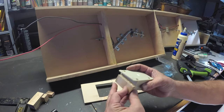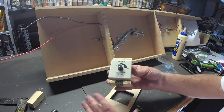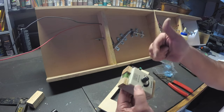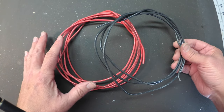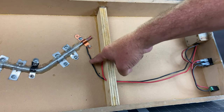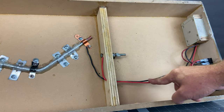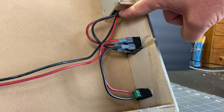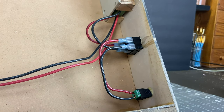I'm using a hot glue gun to secure the dimmer switch to the back side of the face plate. Before I mount it — and before I make another mistake — I'm going to wire this up first so I have enough room to get in and out before I put it on the plate. I've got some heavy duty 10-gauge wire left over, but you don't need to use this — you can use any size wire you want. The wiring is actually quite simple: the black or negative wire attached to the zinc bar goes to the V-minus out terminal on the dimmer. The red wire attached to the bolt goes to the V-plus out terminal. Next, both the negative and positive wires on the top of the on/off switch are connected to the negative and positive in-terminals of the dimmer switch. Finally, the lower positive and negative terminals of the switch are connected to the power source.